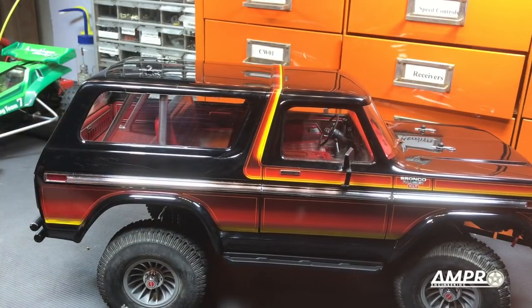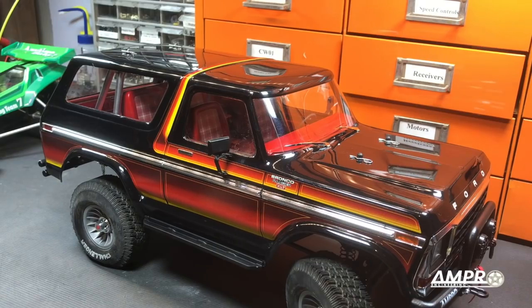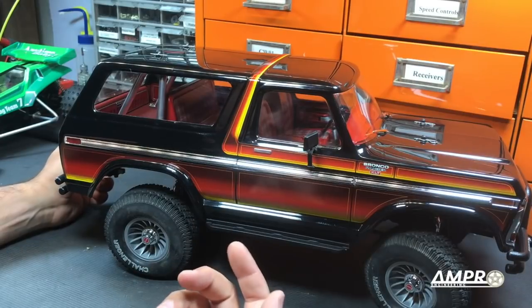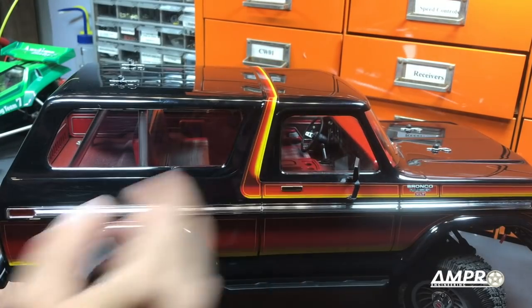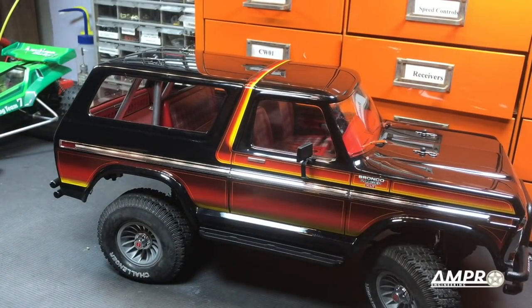There are side panels on both sides of this interior which can be printed laying flat so that in the Z direction it will allow very fine detail to be laid down. Parts like the roll bar here — the silver portion — will be fantastic printed in FDM or a filament printer. But I also wanted to mention detail. This interior set is quite extremely detailed, and the problem is a lot of FDM printers or inexpensive printers like the MakerBots, while excellent for larger applications like the main interior bucket and the roll bar and the steering wheel and maybe the dash, are not going to do well with details like the instrument cluster that has wall thicknesses for the numbers of 0.25 millimeters. These are really, really tiny details. The stereo knobs are tiny, and even the air conditioning vents have details under 0.5 millimeters.